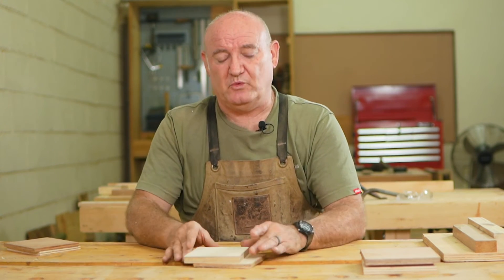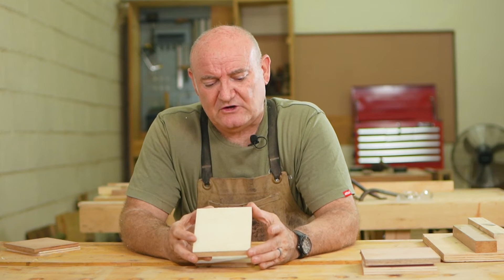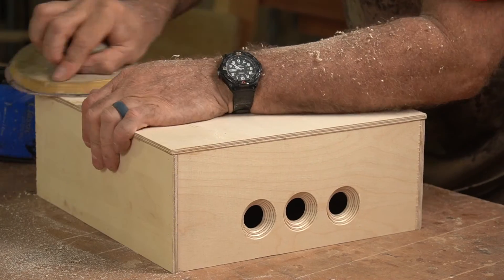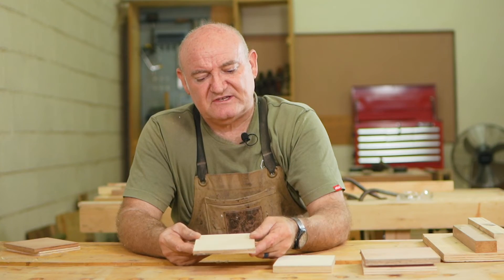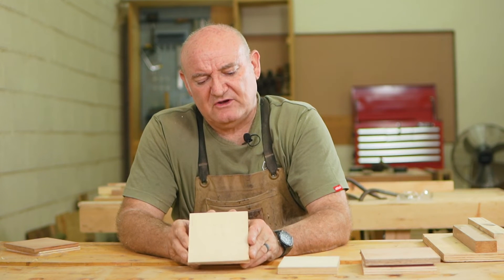Solid wood moves back and forth — especially naughty woods like oak. Oak is like a teenager: it doesn't do what you want it to do. It's beautiful but not very stable. Whereas birch ply is more like a mature adult. This stuff is stable, easy to work with, and its strength to weight ratio is off the charts. The next grade down is BB on both faces — just one grade down from SBB, but still just about the best stuff you can find. It cuts better, machines well, takes finish, you can sand it.